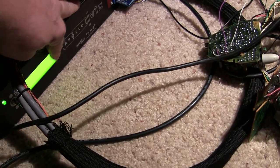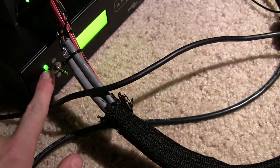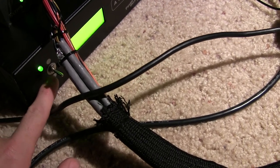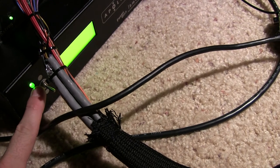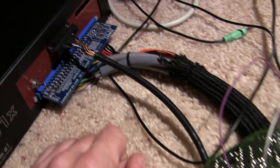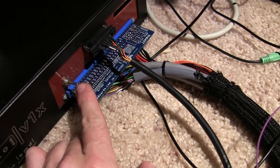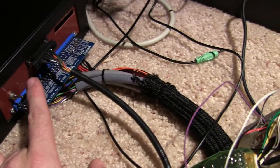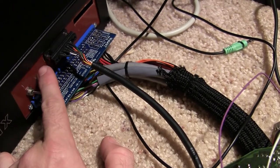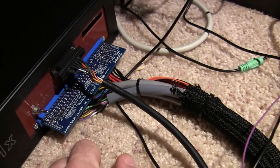It's got an LCD readout that I'll be using a little bit later. I have this LED that goes to the power supply — it indicates the voltage. It's green because it's roughly about 5.19 volts. This is my little tweaking pot right here to adjust that; it'll turn red or yellow depending on the voltage. I have a video switch here for amplified and unamplified video, but it's not enabled anymore because I had some issues with it. I have a controller port — a Neo Geo controller port. I've kind of hacked it up, got a temporary plate in there, and I'll be doing a metal plate when it's been finalized in design.